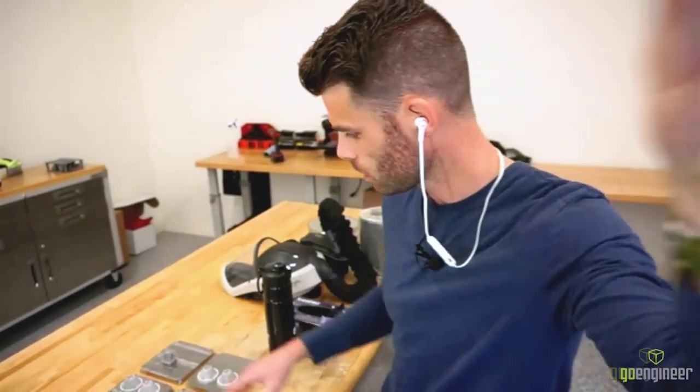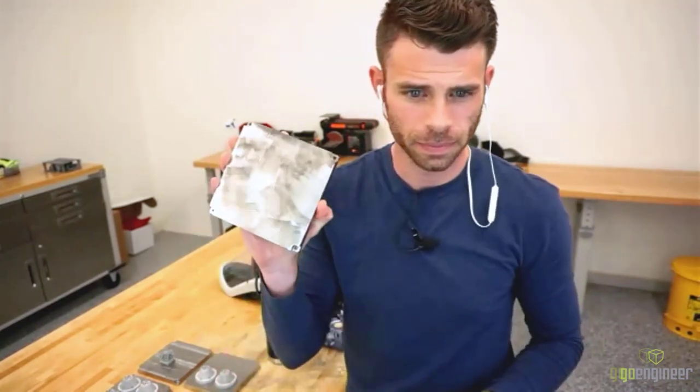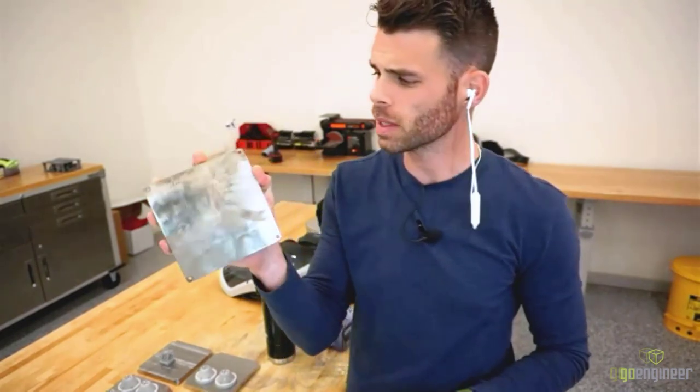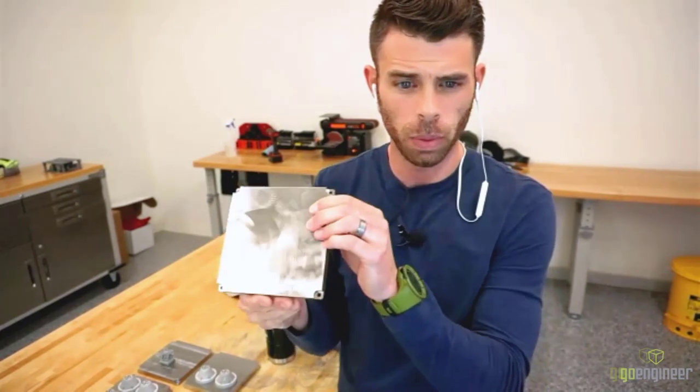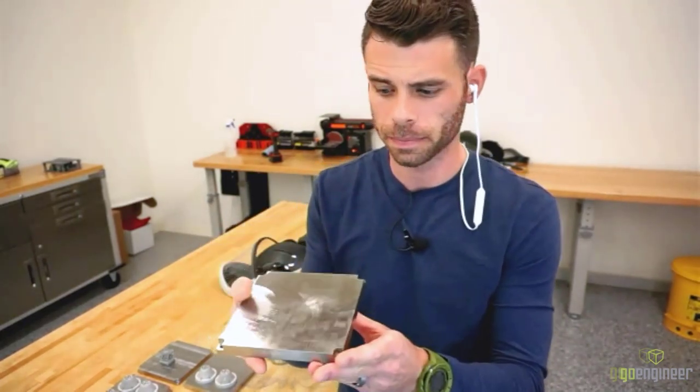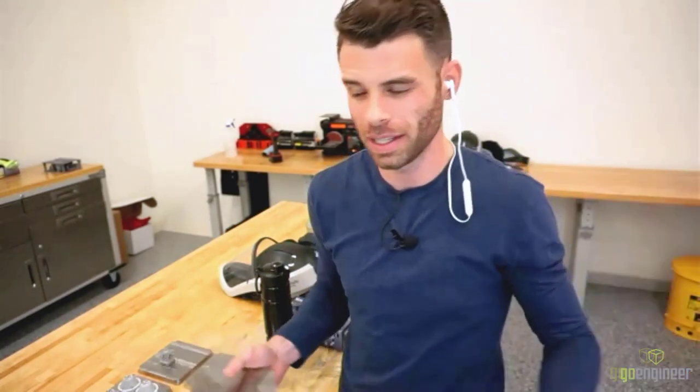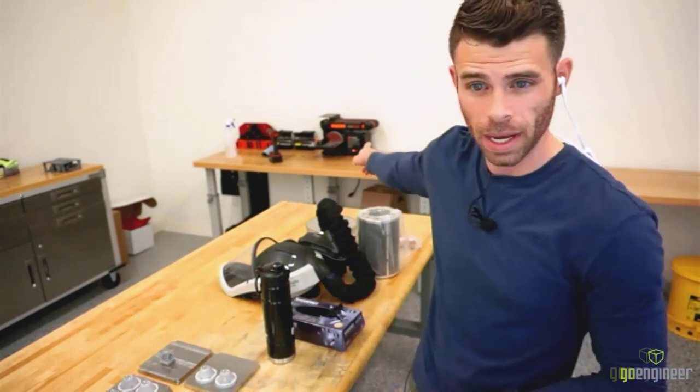Let me show you some parts we've printed. First, here's a blank build plate — a little over five inches square and about half an inch thick with four bolt holes for mounting inside the machine. This one has been resurfaced with an angle grinder because our Tormach isn't plugged in yet — we've only been in this office a few weeks. The machine itself is very tolerant of some imperfections in the base plate, so we can get away with using a belt sander or angle grinder.